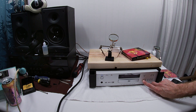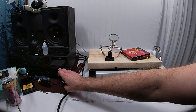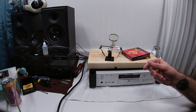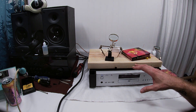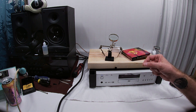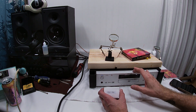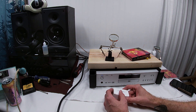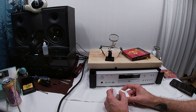Let me get it going so you can hear a song. Well, that's awesome and all, but it chatters really bad, which is a symptom of an adjustment that still needs to be made. Without being able to hook it up to scopes or find the schematics to know where the potentiometer taps should be, it's just a huge pain. I'm hoping the new part comes already ready to go so it won't chatter as bad. The sound quality is a little low — that's due to the adjustments. If the laser isn't focused just right, or doesn't have the right power level, it's going to produce bad sound. That's what it boils down to.